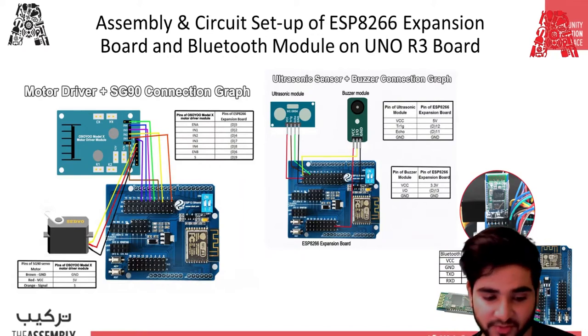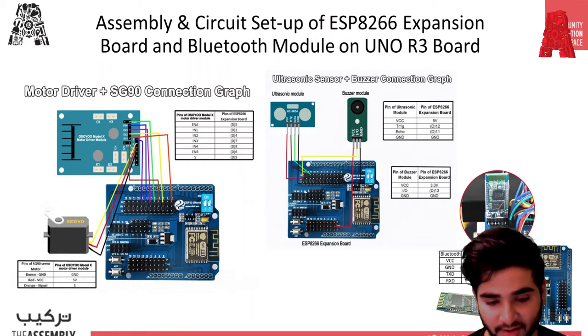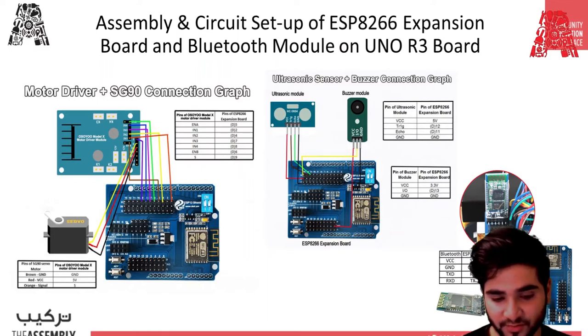And finally, enable B pins are used to control the rear motors. Pulling this high will make the motors spin. Pulling it low will make the motors stop. Removing the jumper and connecting this pin to a PWM input will let us control the speed of the rear motors as well.